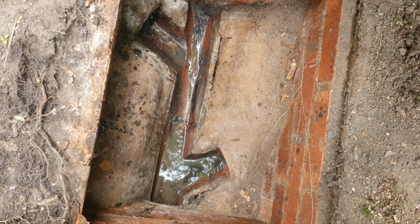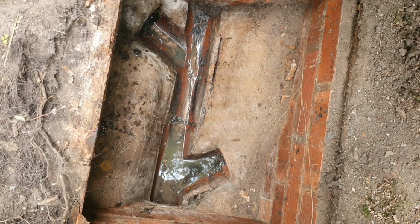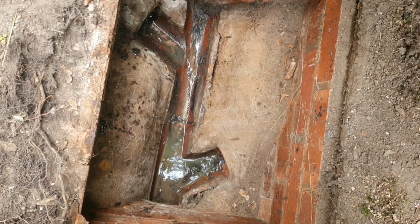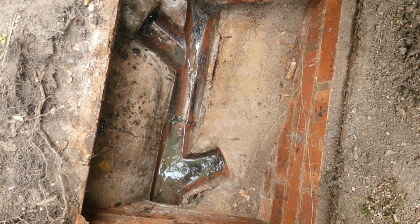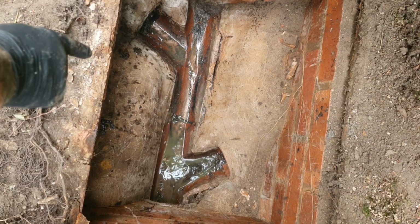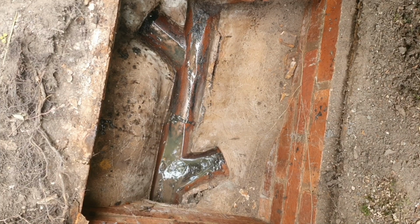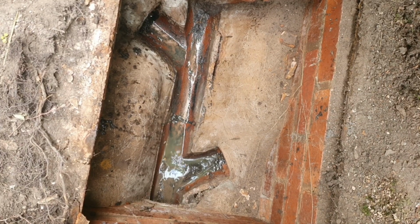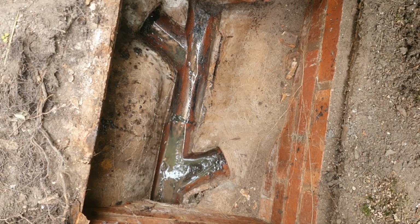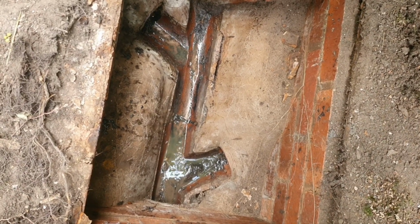Right, okay. Potentially, it would be an idea to put a gully in, and you could come straight in to this manhole now that we know it's here. It wouldn't be such an extensive dig. I could literally just bring it in further up, so it's only rainwater, it's just going to cascade down the benching. And of course, we can repair all the inside of that at the same time. And would you say it's holding the water up? Is it just roots? There's roots in there. It's the trees.